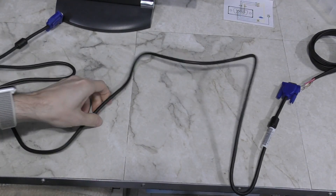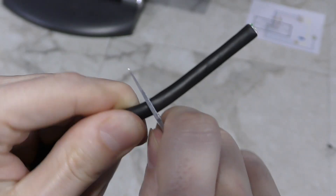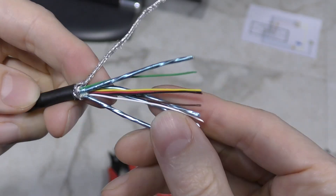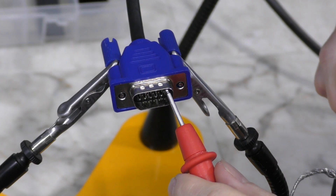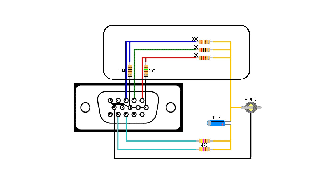Now it's time to build a cable. I'll start by chopping this extra VGA cable in half, stripping back the insulation, and untangling the shielding. Now we have a million wires — I'll use my multimeter in continuity mode to track down which wires go to which pins. Take a look at this diagram I found online showing how to wire up a VGA signal to connect to a composite television. I should preface this with the fact that this design assumes the VGA port is outputting the correct frequency for an NTSC television.